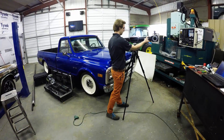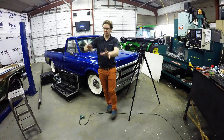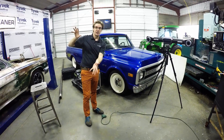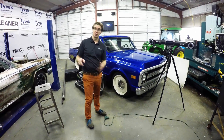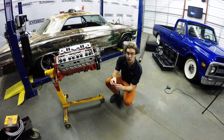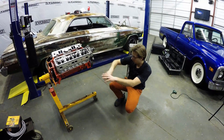So what does the C-track portion do when you start scanning? The C-track sees a fixed volume in front of it of what we're scanning. It gives us a couple of benefits — it means we can use fewer tracking targets within that volume, just five or six points, so it can figure out what it's looking at and what its boundary is. We put targets directly on our engine here — these are little magnetic targets that just snap right on. They have swivels on them, and because it's all mounted together in the scene, the C-track will see these targets and know where it is in 3D space.